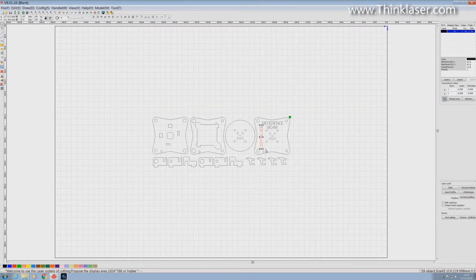Now we must press the Shift key on the keyboard without catching any other complete object, and you'll see that I can start off outside the outside shape, steer clear of the hole. I can go across, steer clear of that hole on the right hand side, and steer clear of these little slots at the bottom, and I can collect that one as well. So now I've added all of these pieces together into a little group. We haven't actually defined them as a group, but they have just been marked as a group.